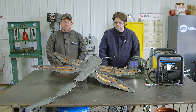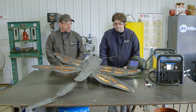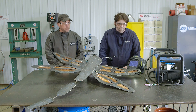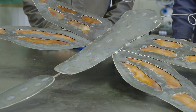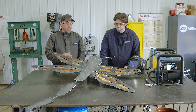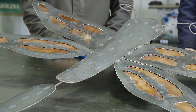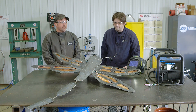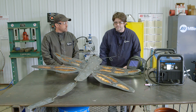I finished up the dragonfly piece — it's a little outside of what I normally do but it's a cool story and I'm glad I was able to do it for Joel. Using the Multimatic was great; I was able to MIG weld the body and then switch over to TIG in about five seconds to do the silicon bronze brazing for the copper. It turned out really cool with a lot of neat contrast. Joel said he thinks it's absolutely beautiful — putting the copper under the wings was more work but it turned out great. He can't wait to bring it to his mother's house and surprise her. For more on what Josh does, visit browndogwelding.com, and for more on the machines, visit millerwelds.com.